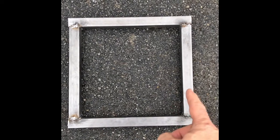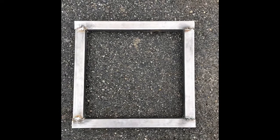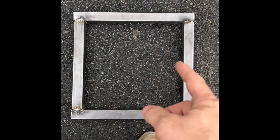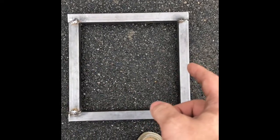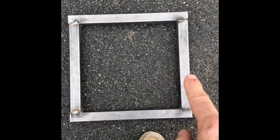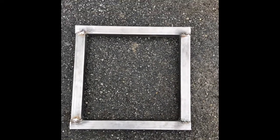The 14 by 14 is the dimensions used for all air conditioners — that's just the universal size. So you want to remember that from here to here is 14 inches. But when you go to weld this into your framework, this is an inch and a half, and this is an inch and a half, so you have to add 3 inches to that 14 inches. So you've got 17 inches from this point to that point. You have to remember that when you go to make your cuts into your framework.